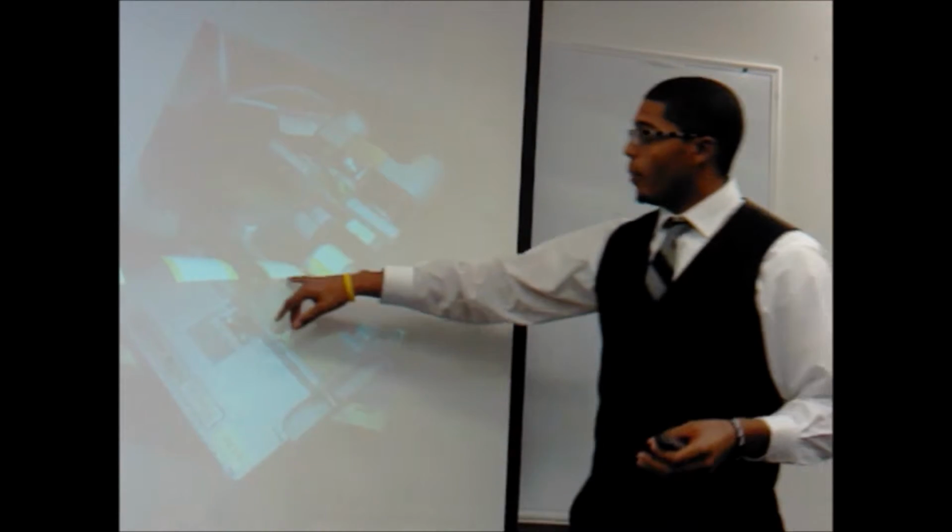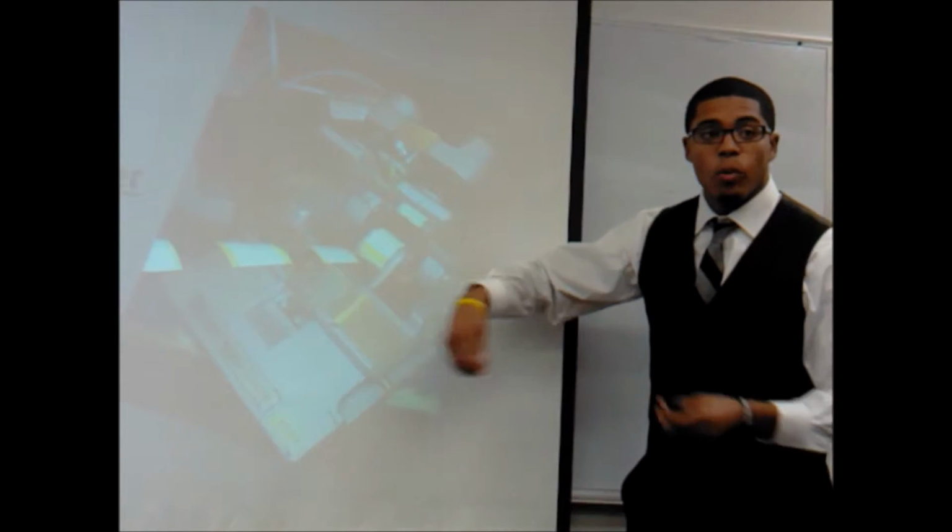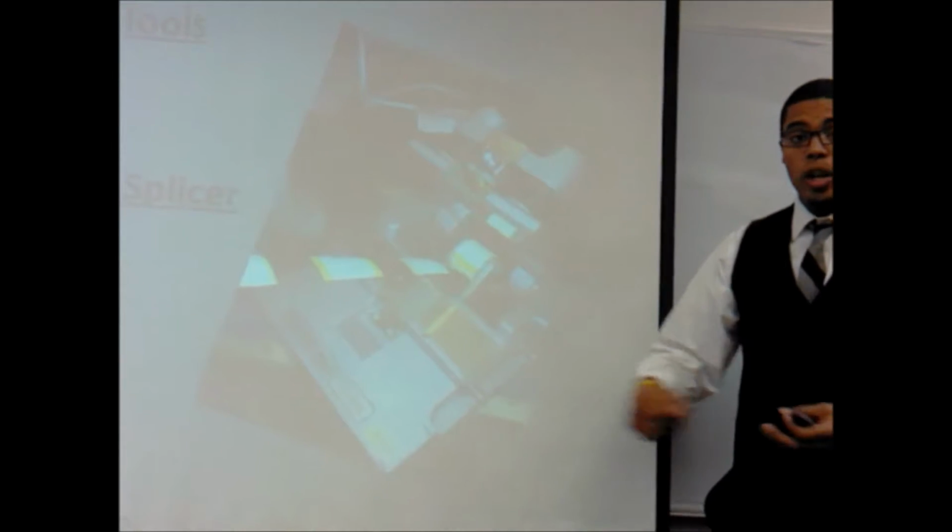This right here is the splicer. This is what puts the movies together. We take this long piece of tape and we angle both pieces of film right here to the middle. We tape it and then we clamp it shut, which connects it together. And that's how we get each reel that comes in a box together, which forms the whole movie.